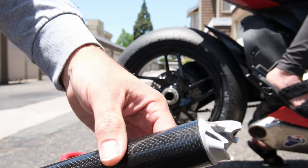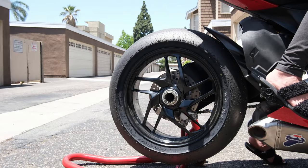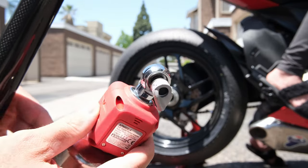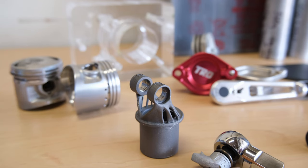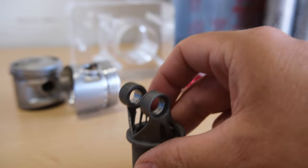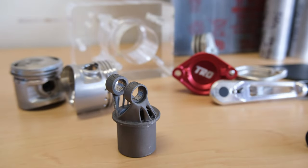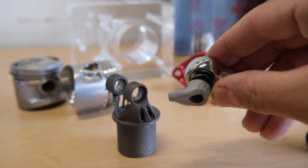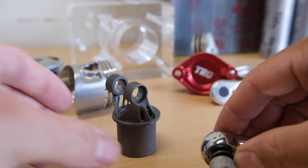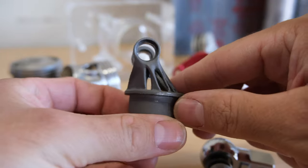So Fusion 360 was off. Look at that — the logo is still attached on there. Just to clarify, this test used the outputs directly from Fusion 360 with no additional engineering. When it said a factor of safety of five for that part that just broke, I took it directly as that. I did check in SolidWorks and it said it was going to fail a lot sooner — the stresses were extremely high. So I'm not expecting much from the titanium version either, even though it's a stronger material, because the geometry seems much weaker.